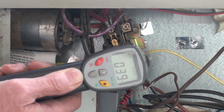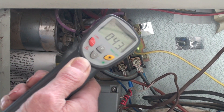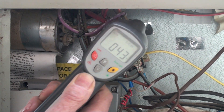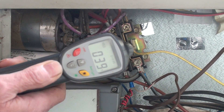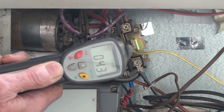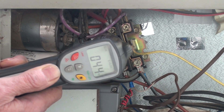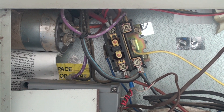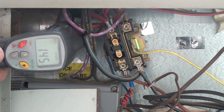I've got about 43 degrees over here, and in the ambient I had about 39-40. Up here I got maybe a little more — 44 degrees versus 39. So the only rise I have is right there in the contacts. That's pretty much telling me where I have any heat buildup at all.